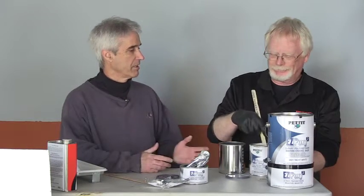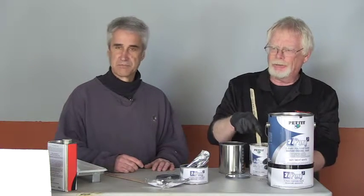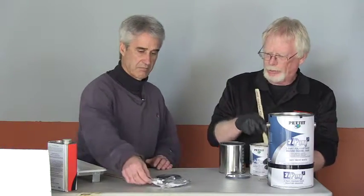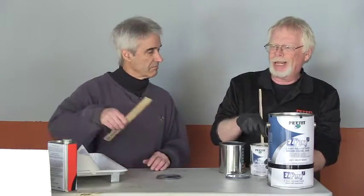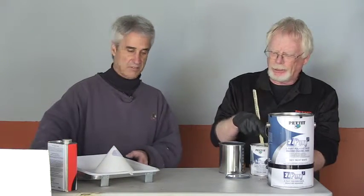How about humidity? How does that enter into this whole process? All of those condition changes affect the paint, and high humidity, high moisture in the air, slows down and retards the dry. Usually warm temperature speeds it up, cold temperature slows it down. Windy conditions will speed up the setup of the product, whereas stagnant conditions will do the reverse. So the conditions very much affect the setup of your paint.